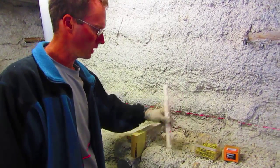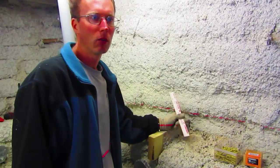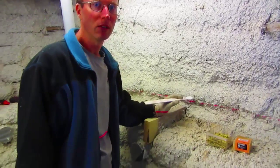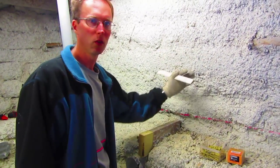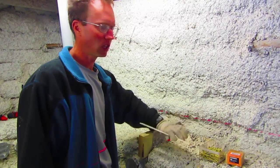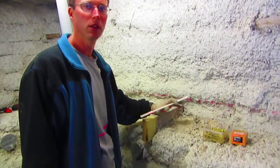The whole reason why this shelf is out here — I think it's been explained in previous videos — is that where we're standing right now, we're actually four feet below ground level. To prevent the pressure from the ground outside pushing the walls in, we did a double set of bags here and crisscrossed the barbed wire across them as we went up on the layers.